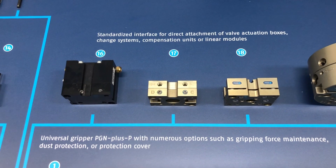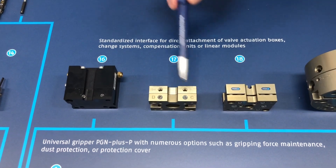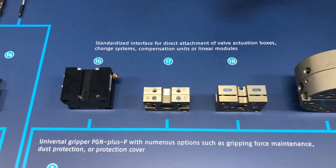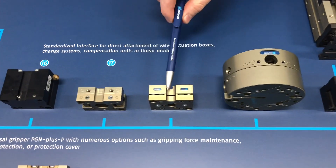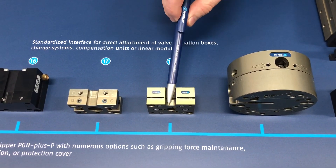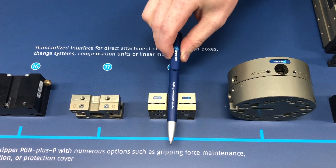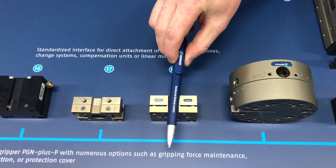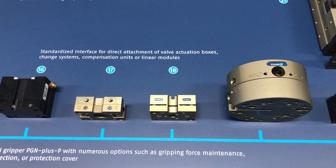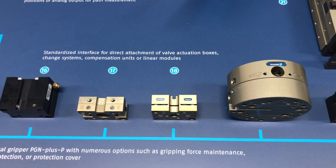Really, it's just a good way of quickly and simply changing that gripper. It's also adaptable to a number of different other gripper families because you have the same mounting points. You can go from an angular gripper to a fully sealed gripper to the PGN Plus P gripper all in one. Here we have a TCU, which is a tolerance compensation unit. This unit is directly mountable to the PGN Plus P, and we also have sizes that will mount right to your robot. It can be used for angular compensation—so if you have an application where you might run into some binding, or you're gripping a cast part with some dimensional variability, this can help you pick up that part over and over again.